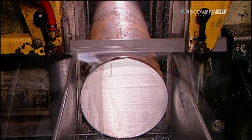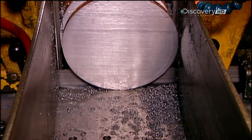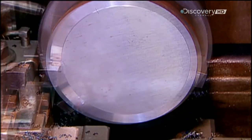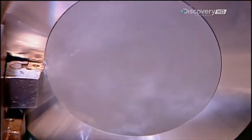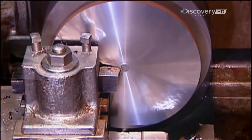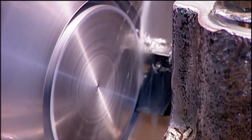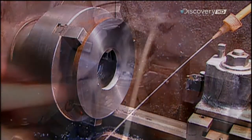To build the internal magnetic structure, the factory begins by cutting two plates of iron, each about 13mm thick. They go one at a time onto a lathe. First, the machining tool smooths and evens out the surfaces, getting rid of any marks made by the saw. Then it cuts a small hole in the centre of one plate, and a larger hole in the centre of another.